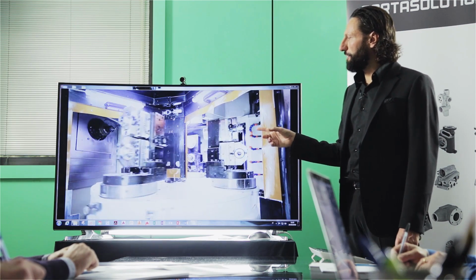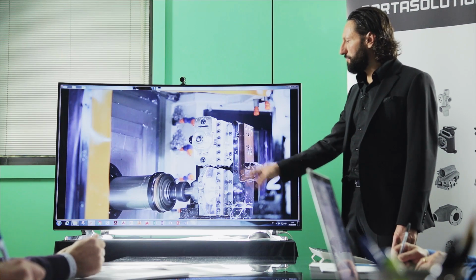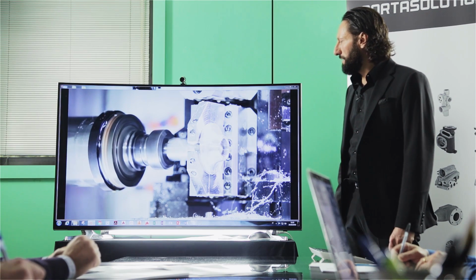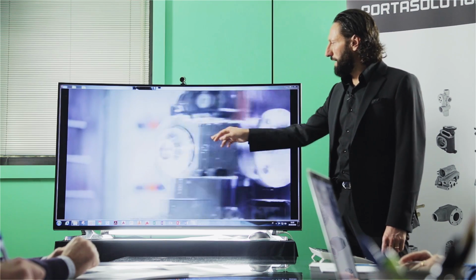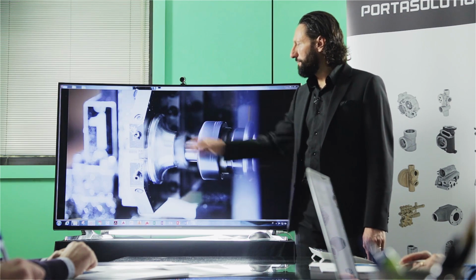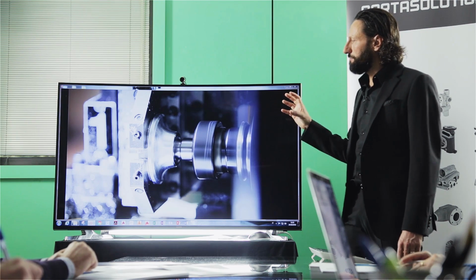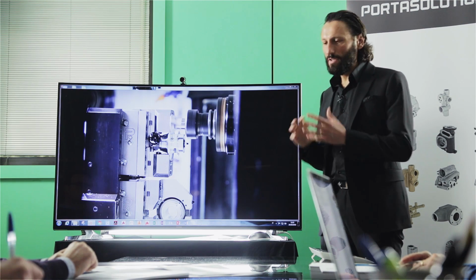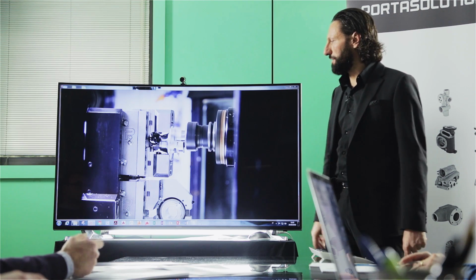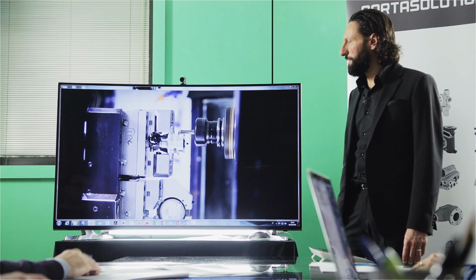In the video you see, we are not really machining because without the coolant we can't see anything. But just imagine that we are cutting real chips. So this is still a rough area. The main problem here is that this area has very high tolerances and needs to be concentric to the main bore, and even the radius has very tight CPK values. So we couldn't make a plunging operation because of the quality of finish. It needs to be single pointed, and the parts need to be put in rotation to keep the concentricity. So what we did, once we finished all the milling operations, drilling,